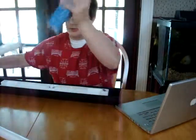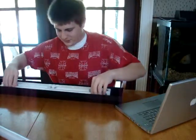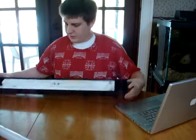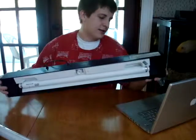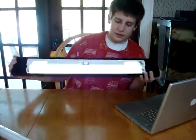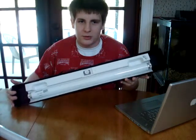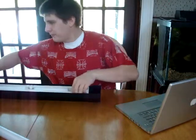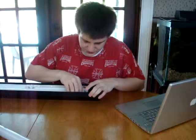These bulbs are fat — I'm used to dealing with T5s now. As you can see, it's just sitting here flickering. It won't actually start. I used to have one of these with a ballast that would start it, but I sold it. So just so you know: if you have a T12 fixture and want to upgrade to a high output bulb, it won't even start with a standard starter. I tried using a stronger starter and it wouldn't even light up the original bulb, so it's just not made to work even with the same fittings.